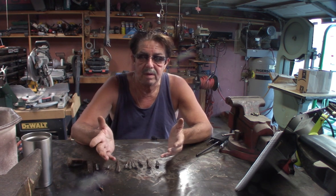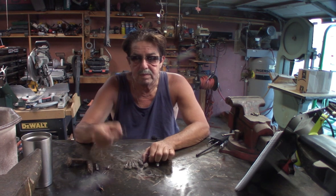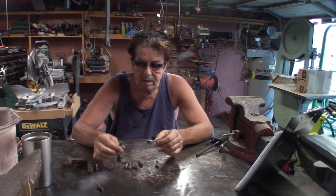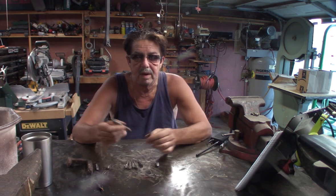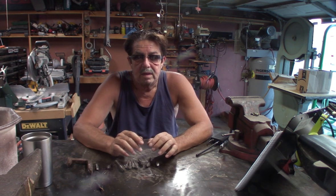Even if you go the tungsten route — but I'm an intermittent user and these have held up well, edge is still nice and sharp. Can you use them on wood? Yes, but I always drill a pilot hole first before using these. It's so much easier to come down onto a pilot hole. You don't have to on soft wood like pine, Douglas fir, or plywood, but I do it out of habit.